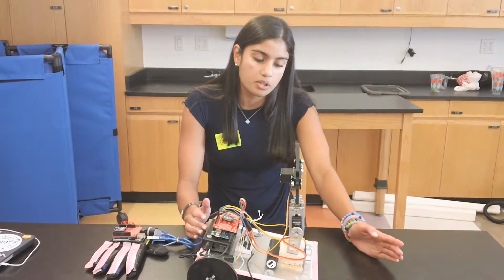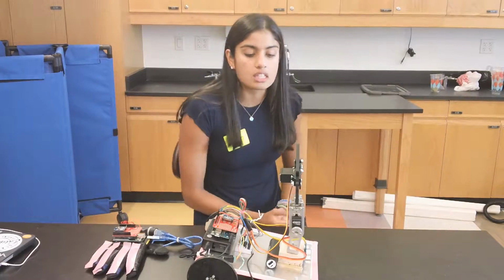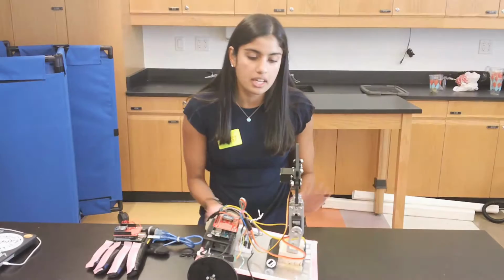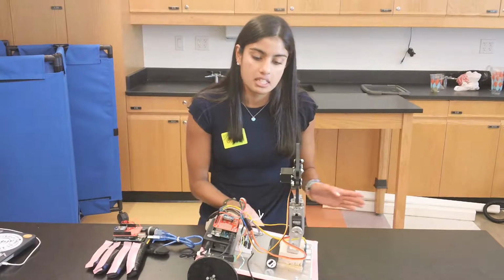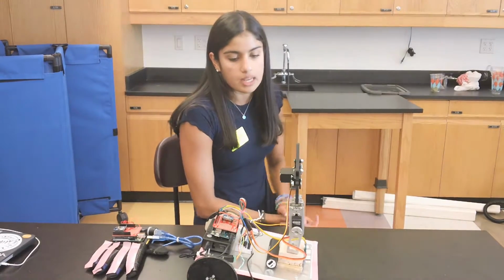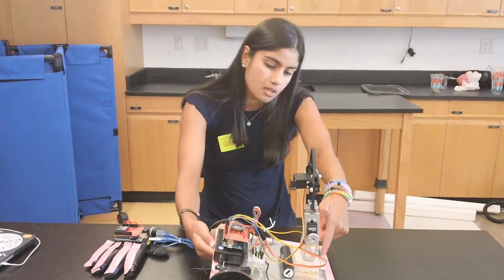and then there's an equation that allows you to calculate the distance that the sensor is from an object, and that's the time it took for the sound wave to leave one side and enter the other, divided by 2 times the speed of sound. So I took that information and created a code that, as I said, allowed me to stop the motors when the chassis came within 10 centimeters of an object. And I added this code to my coordinator code and mounted the ultrasonic sensor to the front of my cart.